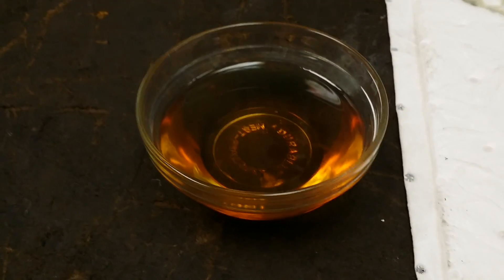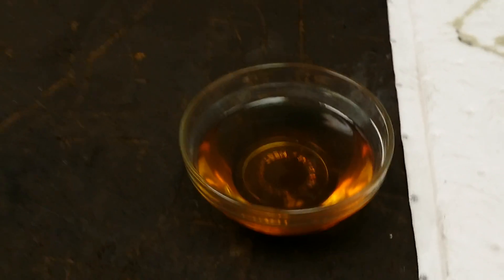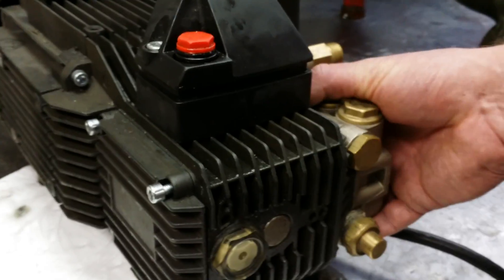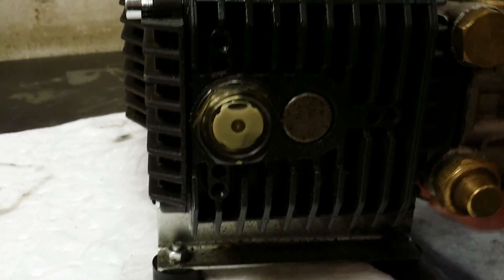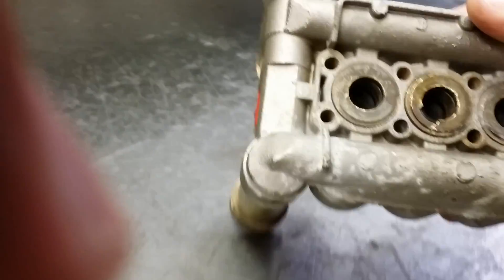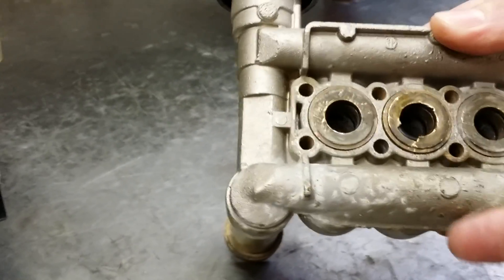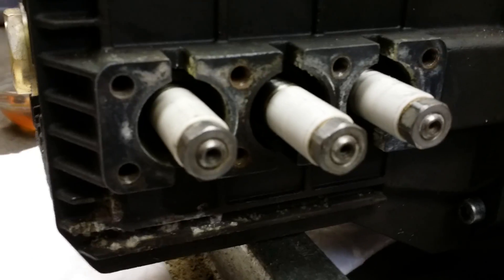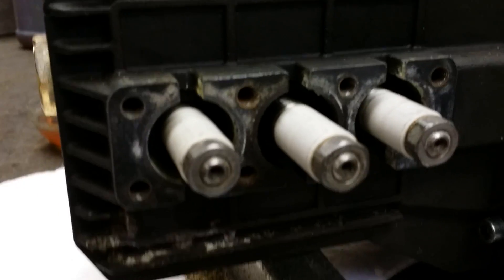This is the color the oil should be. Between the manifold and the pump, the crankcase has an open air section. That open air section allows water to come out of the water seals and be vented down the inside of the manifold. We also have an open air area in front of the plunger rods. That open area should allow oil leaks to be vented as well.